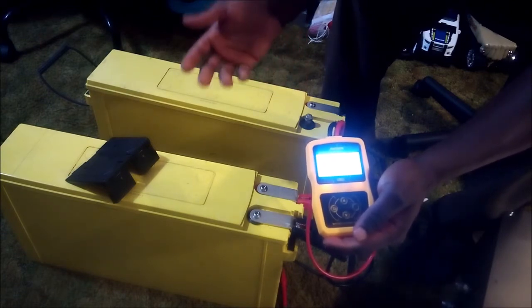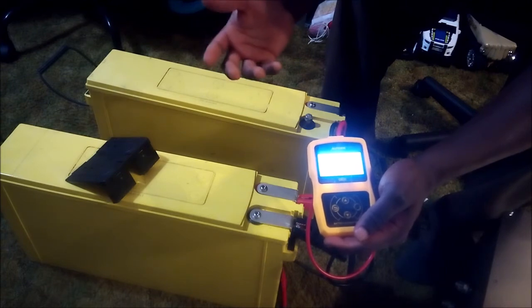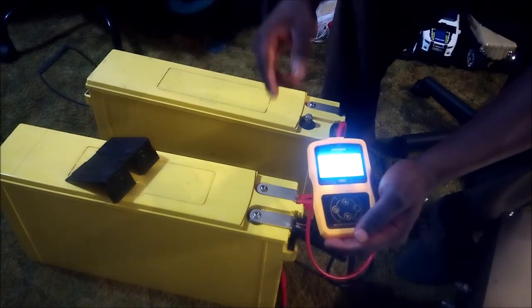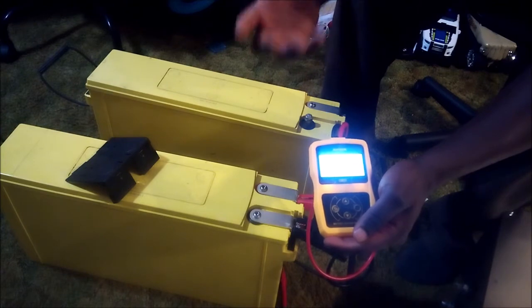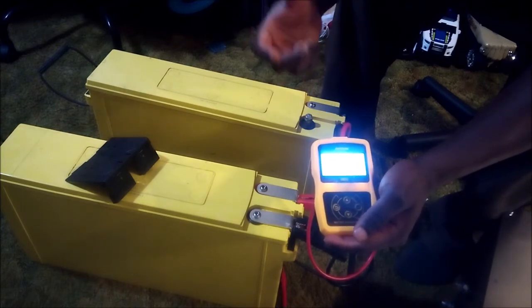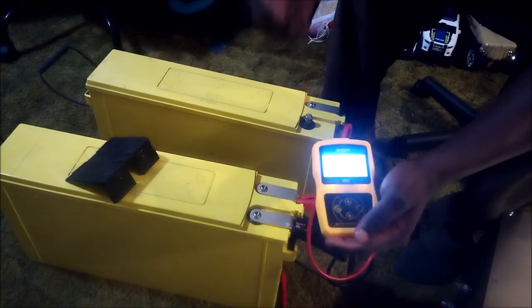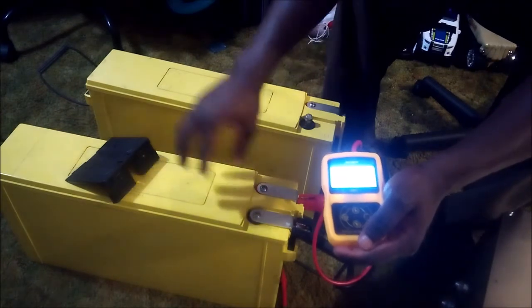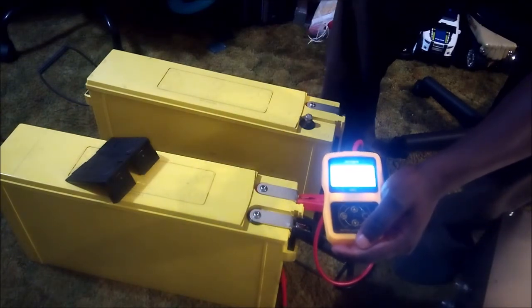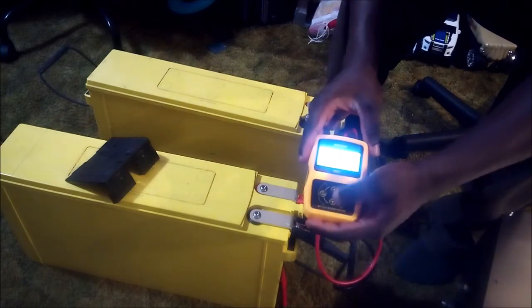Now you would ask, why is this important for a battery that you want to use for a solar system? It is very important because let's say you're using a submersible water pump, or you want to use your microwave, or your washing machine. These kinds of appliances surge at a higher rate. For about 5 or 6 seconds, in order to keep their operation going, they will surge 3 or 5 times the original rating of the appliance. So you want to make sure that your battery is able to hold on to its own power and regain strength to be able to continue running.